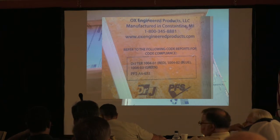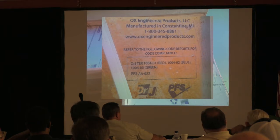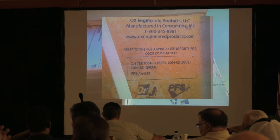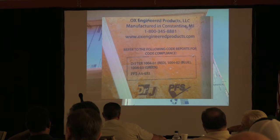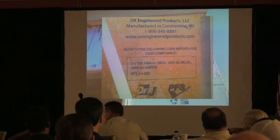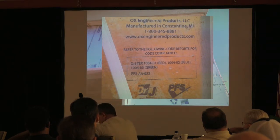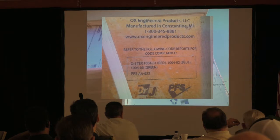Yeah, John. This is also used as a house wrap too. So they've got to tape it right as well. Yeah, I forgot about that. So it's supposed to be taped. Right. Yes. But I think they've got a special way of wall bracing and everything on the studs before you attach that. What do you mean? Because it has structural tension only, but it doesn't have wall bracing characteristics. So you've got to build that into the wall before you put that. Well, you'd be surprised, not according to this.